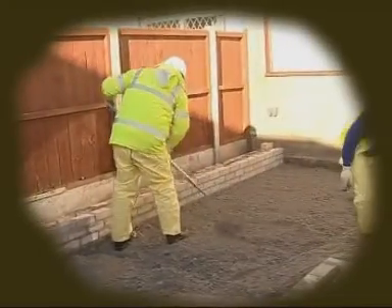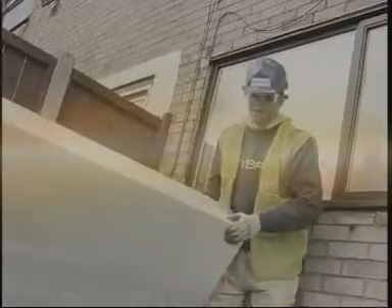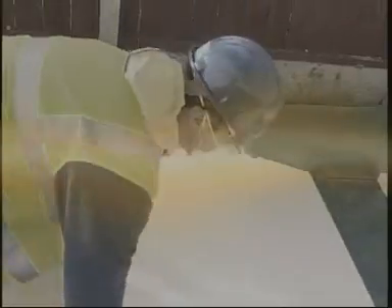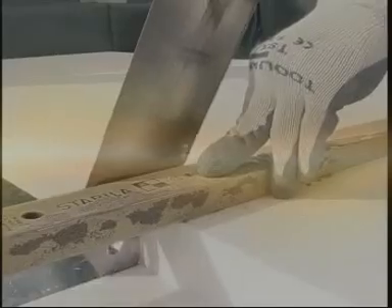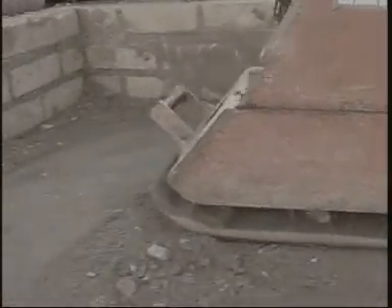Let's take a look at how the competition are doing. Oh dear, they're already lagging behind. And what a mess. Apart from having to handle all that heavy hard core, the guys are using polystyrene sheets for secondary insulation. It's awkward to work with — it has to be cut to size and taped up, and in many jobs it has to be laid around pipes and protected from hot water systems. It can be a real hassle and it all takes time. OptiRock, however, insulates brilliantly so there's no need for polystyrene sheets, no need for sand blinding, and no need for compaction equipment — not even a wacker plate. Now how easy is that?